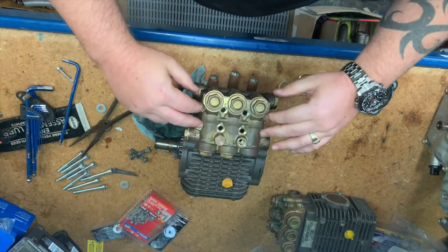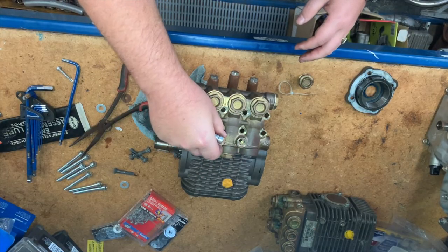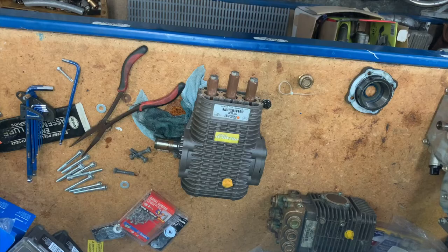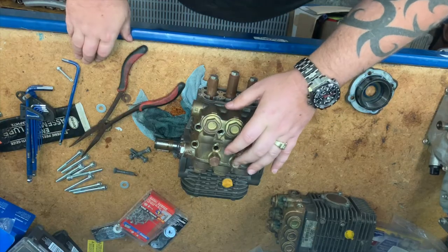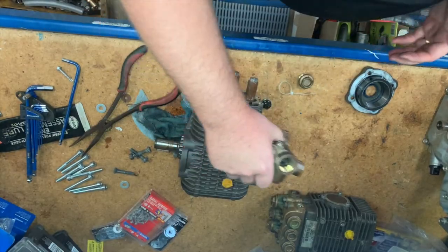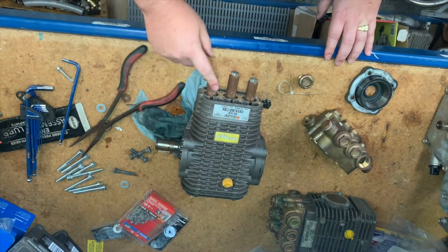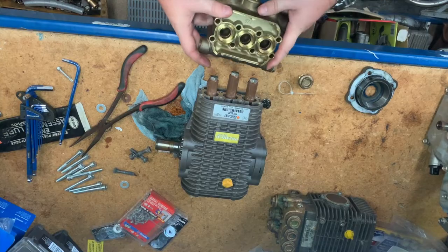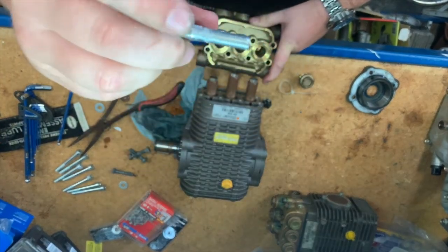On the front of the pump, these 8 bolts are where we took out the head bolts. You'll see here you have a brass nut — these are just plugs, a straight opening inside the pump head. And this is where you can connect a pressure gauge if you like. I have seen some people install thermo release valves there as well — we don't, it's something else to go wrong. There's no head gasket, no actual gasket material, so it's just basically the pressure of these bolts and they are torqued down a fair bit. Make sure you do put some Loctite thread sealant on there — very, very important.